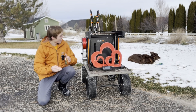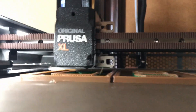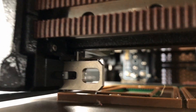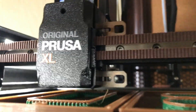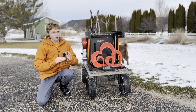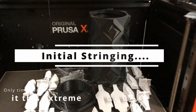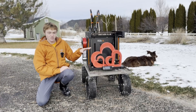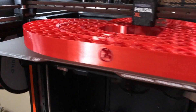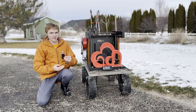First things first is about stringing and the 0.6 millimeter nozzle. A lot of people have been saying to just switch to a 0.4, but I wouldn't do that because one of the major advantages of the 0.6 is that you can print a lot faster. On a good note, the Prusa XL has actually had a lot less stringing than when I initially made the first two videos, as the new firmware update has substantially helped, even with the same filament. This filament was actually the one I had the most issues with, and as you can see, there's really not much stringing — and this is directly off the printer, just printed today. So stringing isn't really an issue anymore.